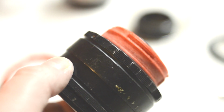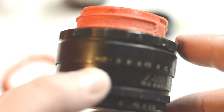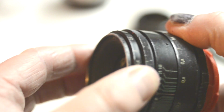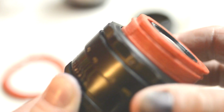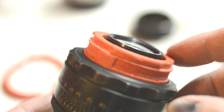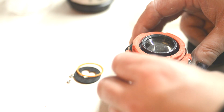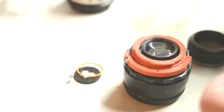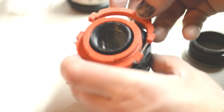And once all those screws are in, I just need to test this out, try the focus to see if everything is okay, and then it's just simply a case of attaching the clamps on either side of that tube. And the screws are so tiny, they're M2 screws, and the bolts even smaller, so fiddly. You have to have good eyes and really good dexterity with this.